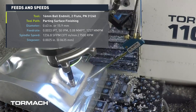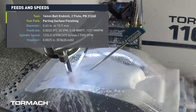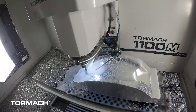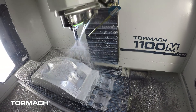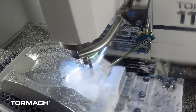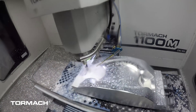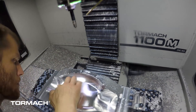After seeing the recutting, I switched to the flood coolant setup to flush chips away and get a better surface finish. I tried a few approaches: straight raster passes, raster passes on a 45-degree angle with a perpendicular pass. What we found was that on the mold cavity itself, the 3D offset or scallop-style tool path gave a really nice finish on the walls. It did leave a faint witness line down the center of the mold where the tool changes direction, but the raster style didn't produce as smooth a finish on the curved walls. The customer was happy accepting that line in exchange for better overall surface finish.